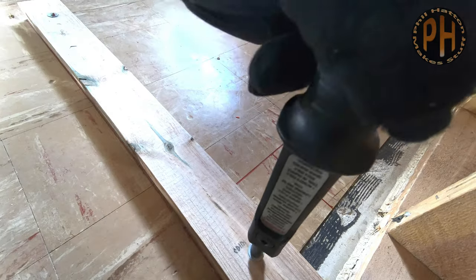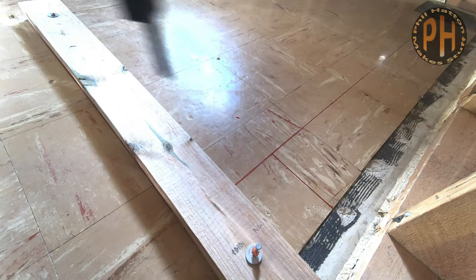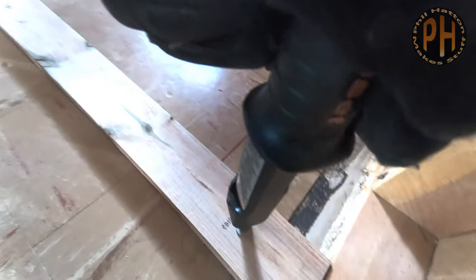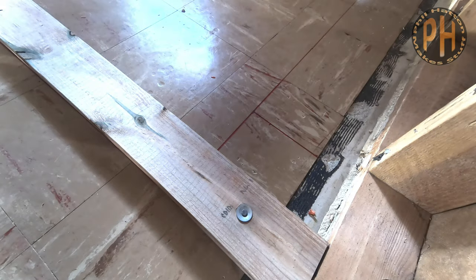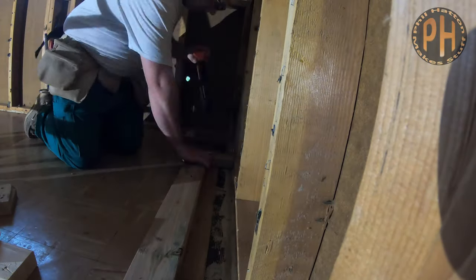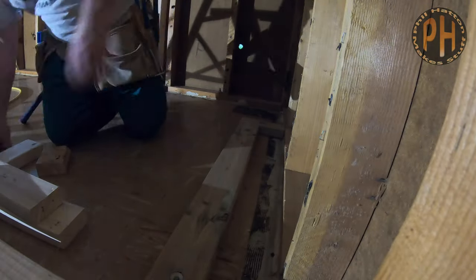I got some advice from an experienced user and bought the yellow loads to go with the nails, which are sometimes called drive pins. There are bigger, heavier duty ones, and even ones that use collated nails and power loads in strips that the professionals use. On a couple of occasions, I needed to use a second load to get the nail flush with the wood. I assume the nail hit something hard in the concrete. As you might expect, you should definitely use hearing protection, although I was surprised that it wasn't as loud as I thought it would be.